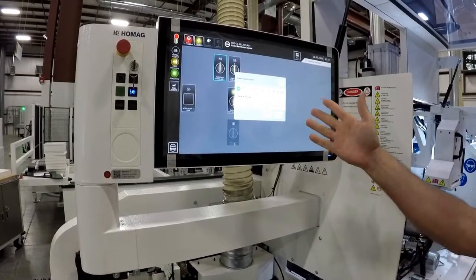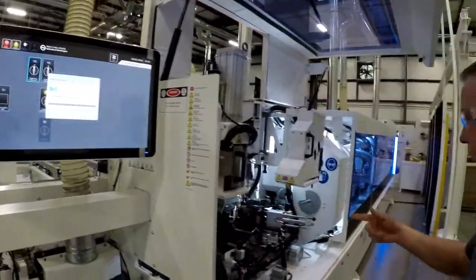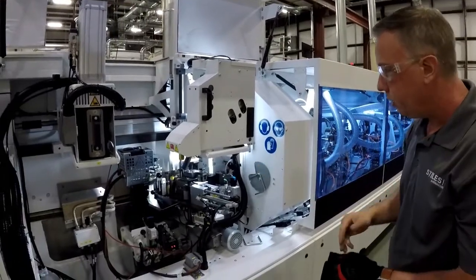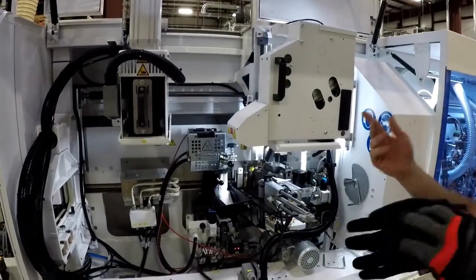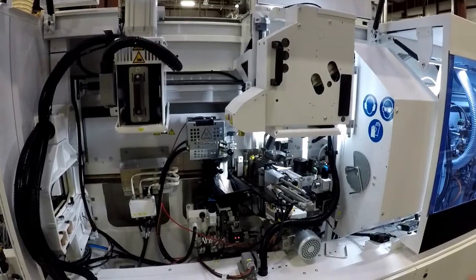It's going to come up with a status, and then we'll start working through the steps. If you come back over here, you will see the pneumatic glue gates on the QA65 system will automatically adjust and turn, and then the roller will turn accordingly to start purging that glue out of the unit.